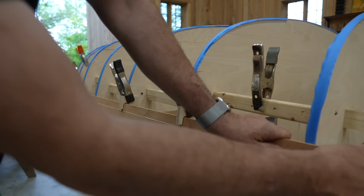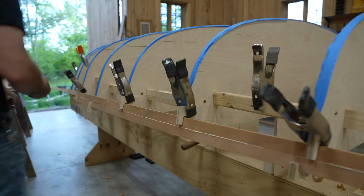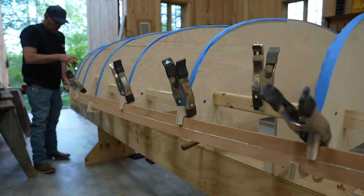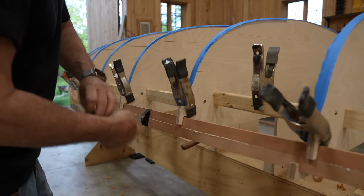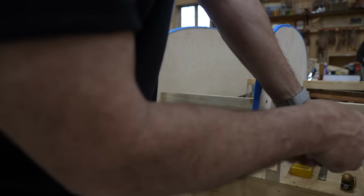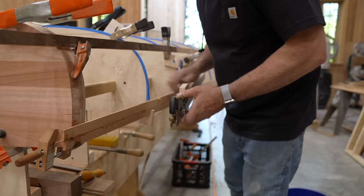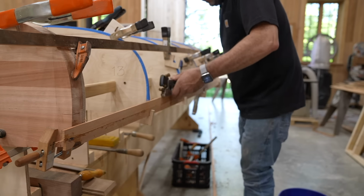Now I'm a little bit of a hack woodworker, but I did do the best I could to get each one of those joints as tight as possible to one another. And so every single board gets hand planed before it gets put next to the other board. And black tape, I learned from my friend Patrick, the electrician, Pat Reynolds, is extremely versatile. It's not just for electric. And I use it kind of like a thin, almost like a stretch wrap.